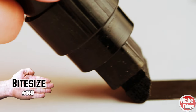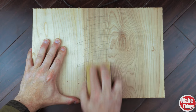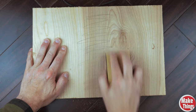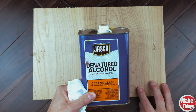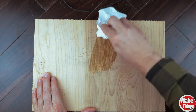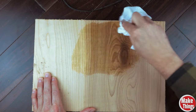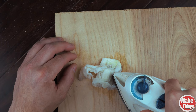If you make things, you're going to need to add marks of some kind to the material you're working with. While sandpaper has been known for years as a wood eraser, sometimes you don't want to sand to remove marks. A good pencil remover tip for wood, or anything you've added graphite to, is a little denatured alcohol. Add a little to a rag and wipe off the marks — it's alcohol, so it evaporates quickly, leaving things dry, and the fibers won't plump up and become raised the way they would with water.